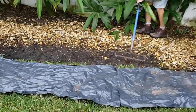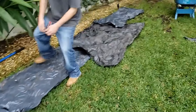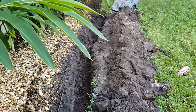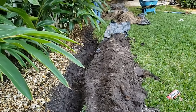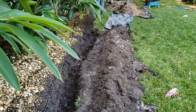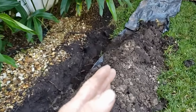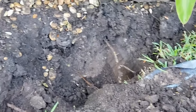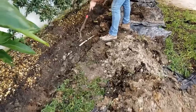We'll set the dirt up on the plastic and trench our new line down through here — real simple stuff. Work is progressing but we have to go slow; there's a lot of things underground here — irrigation, power for security cameras, power for transformers. We also have to veer our trench around certain obstacles. For example, you've got sprinkler heads popping up — you can see that head right there. We can move that, but it's easier to just bend our pipe around it.